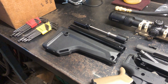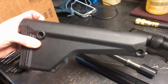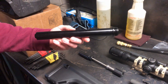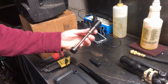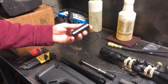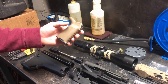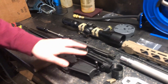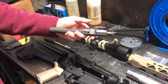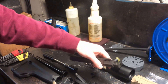So let's start with the parts here that I've picked out for this build. Starting from the back, we've got a Magpul MOE fixed rifle stock in black. I've got a TNA rifle length buffer tube. There's an Armaspec Stealth recoil spring system for the buffer, and an A2 length spacer. Moving along up, we have a Magpul MOE+ grip in FDE, the Stag lower receiver, Stag upper receiver, and the bolt carrier group is a Toolcraft phosphate chrome-lined BCG, MPI inspected and high pressure tested.